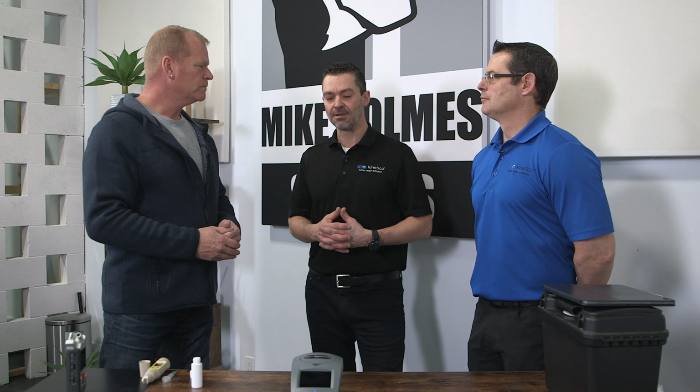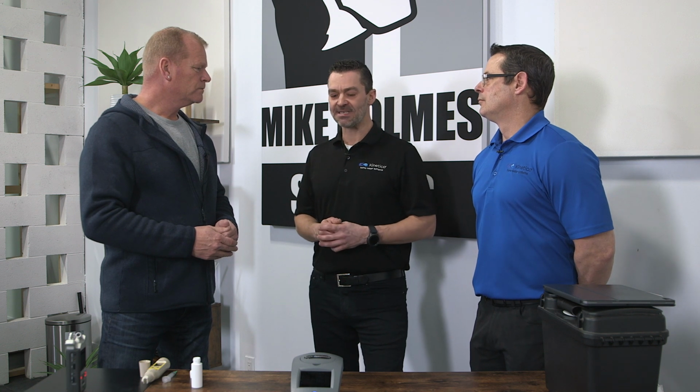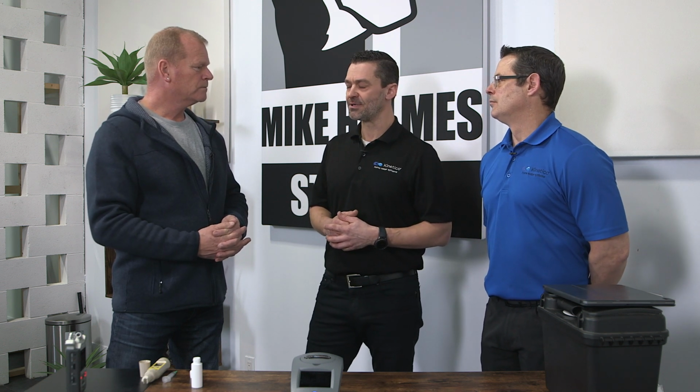What about the pH? What number does that mean? So pH is 7.7. That's a good number. The pH is the measure of the acidity or alkalinity of your water, and the reason that's important is we want to make sure the water is not going to be corrosive. If the pH is very low, then we would want to neutralize the water by raising that pH back up. Neutral pH is 7, and at 7.7, that is actually a pretty good pH number. It gives a little bit of alkalinity to the water. It's going to help with reducing corrosion from acidic water. So 7.7 will help us make sure that the pipes don't corrode and things like that.